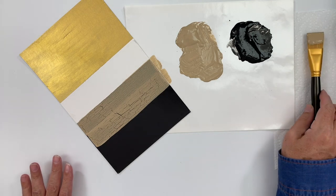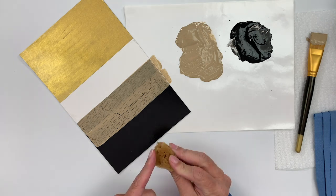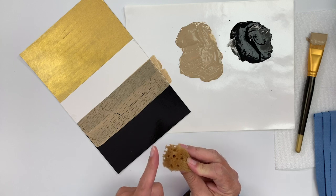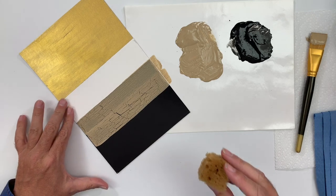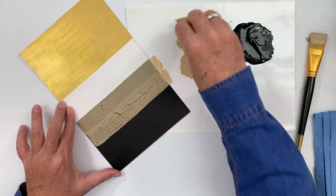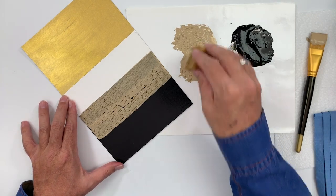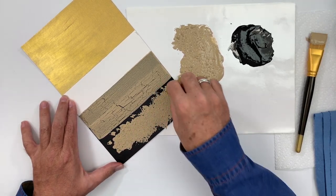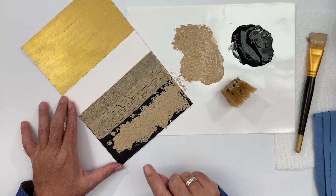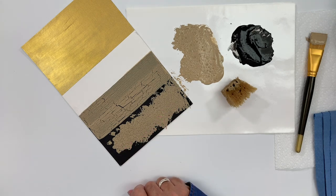Some people want a crackle finish but don't necessarily want it to look like a weathered paint crackle effect. So I'm going to show you how to get an all-over crackle pattern using a natural sea sponge. This sponge has been dampened and wrung out so that it is damp and soft, but not wet. I'm going to dab my sponge into my acrylic paint to load it up, then apply this quickly to my surface and leave it alone — just dab and move my sponge. Because the paint is applied a little thicker, it's going to take a little while to dry, but as it dries you'll see it starts to form a random crackle pattern. And you can see as this has dried that we do have a very nice random crackle pattern.